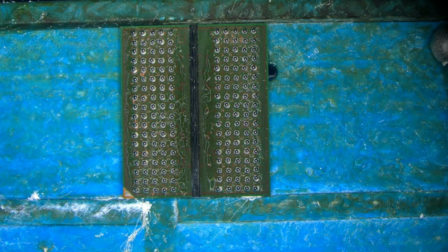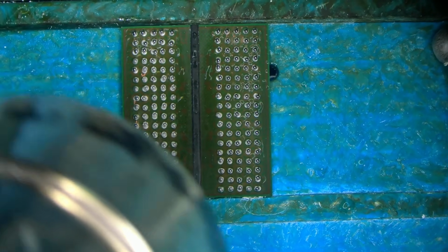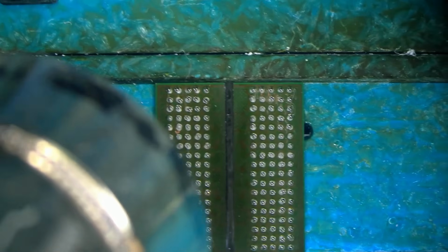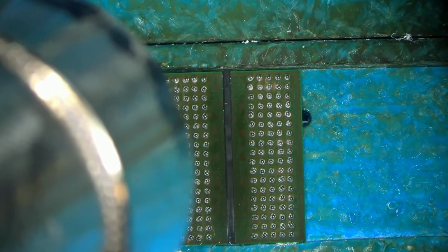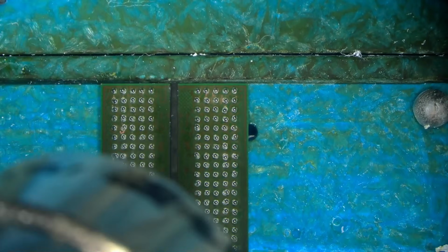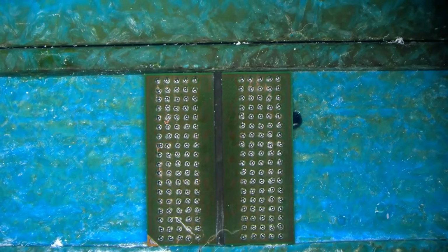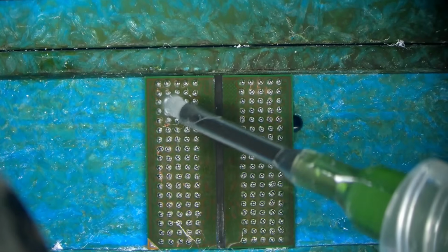But how will that work once we try to apply some hot air on it? That's what I want to know. Let's see what happens when we start blowing air on this thing. Okay, so the balls are getting attached, but there's not enough liquid. There's not enough surface tension in that thin liquid that would allow them to center. You can see here they do not want to center. So we're going to have to flood the chip with something like this Chinese fake Kimbo.